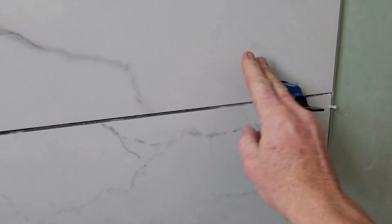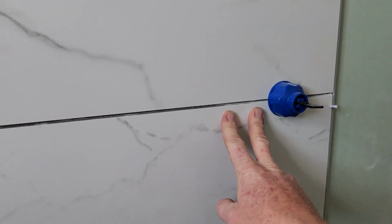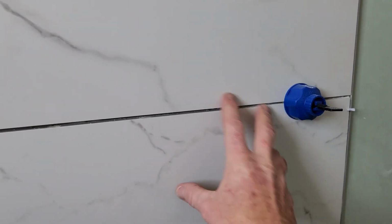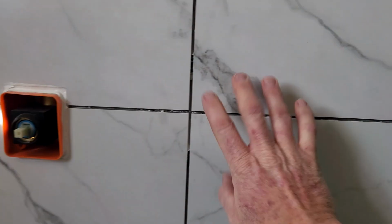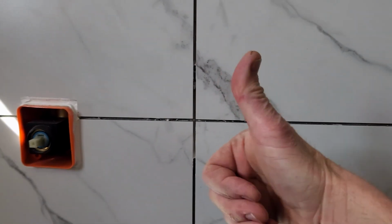What that does is, while that thin set is still soft underneath, obviously, if you've stopped for the night, then it won't level out the solid one that's dried. But if they're both wet underneath, you tighten that down, it brings that lippage up evenly right here on your middle area. Just beautiful. Obviously, flat walls will definitely help as well. Overall, thumbs up in my book.